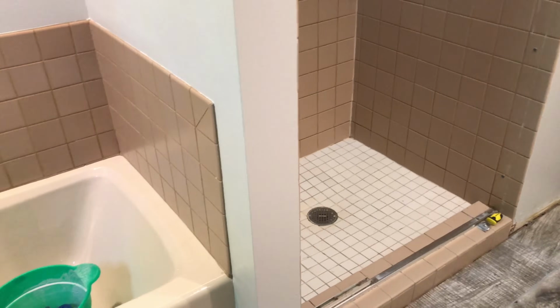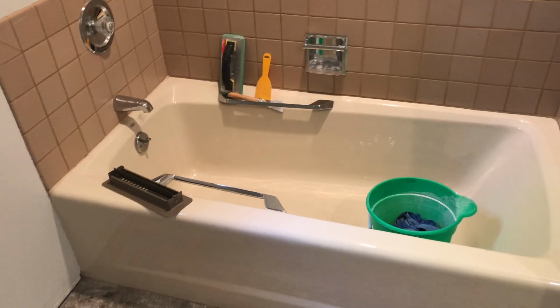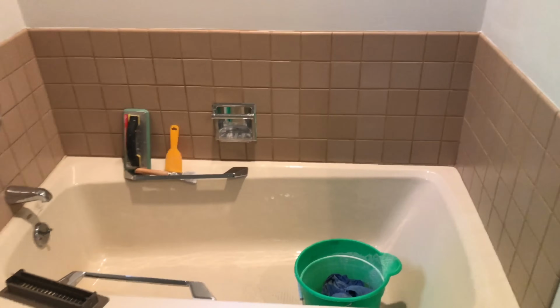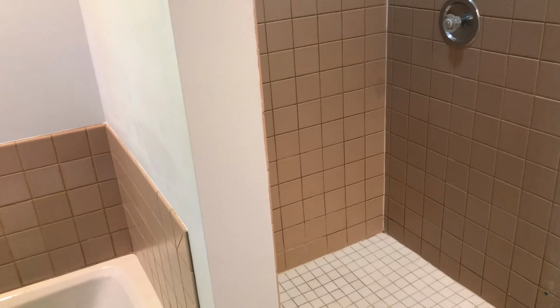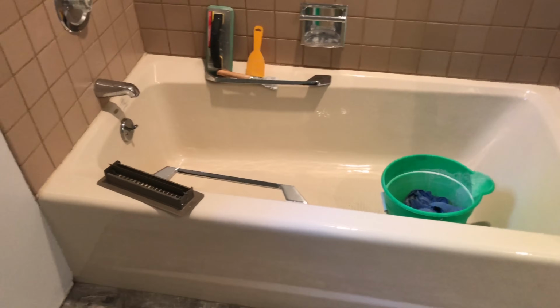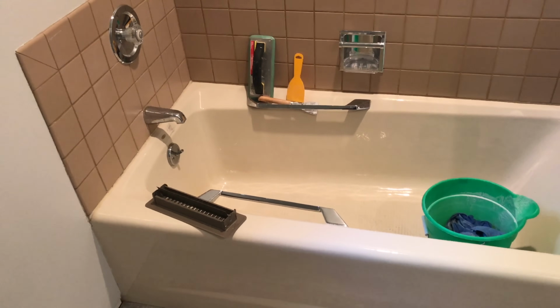And so I have a guy, Tony, coming to do it. He's done it on different bathrooms and products for me before. Basically, it's a simple process of masking off everything you don't want reglazed. And then he applies some sort of acid or etching material onto all of the surfaces to give them a tackiness so that they'll take to the new ceramic spray or whatever he puts on there, enamel. And then he basically uses an industrial spray gun and sprays everything.